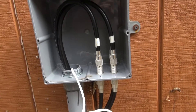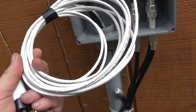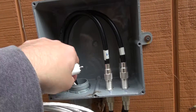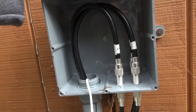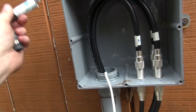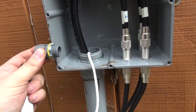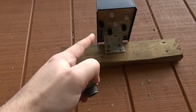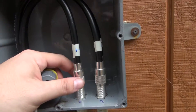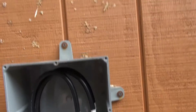We're going to be hooking up my remote antenna switch. I've got it mounted up there, and this is my cable that I'm going to be sending down for my switch box connections. I'm going to put a half-inch hole on the side here, put a liquid-tight connector on the side, run it out and up into the box. I'm going to make sure these connections in here are still tight and relocate a couple of them up to the switch box.